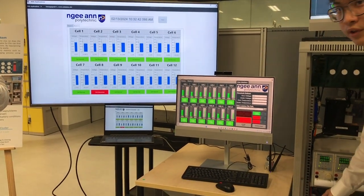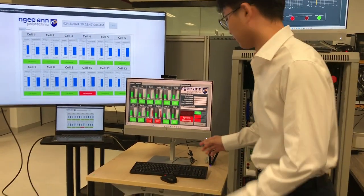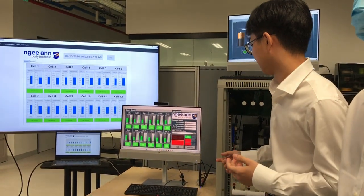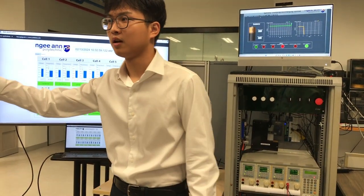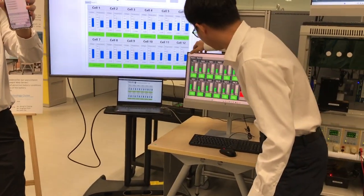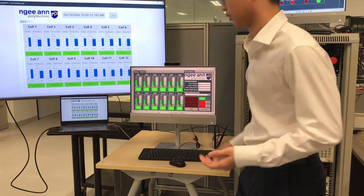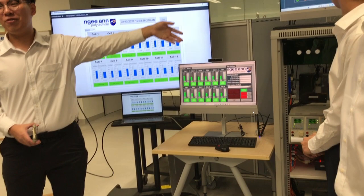Now the relays connected between the DC2259 board and the batteries are open, to ensure the board's safety, and a very annoying buzzer will be turned on to inform the users about a fault that has happened. As you can see, there's also a system warning SMS message sent by the modem. And right now, all the readings are back to normal again. So now the users can just reset and turn off the warning. Thank you. And once this system activates, all the problems will stop. Everything will start itself.